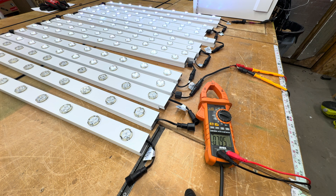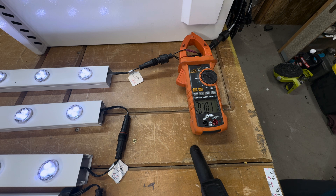With 120 lights at 100% brightness, I'm pulling 3 amps. So we're well within the capacity of the controller — we're just getting too much voltage drop at the end.